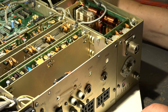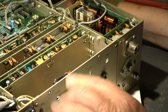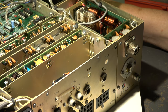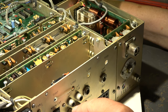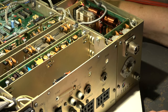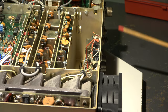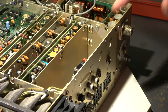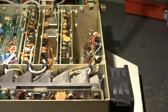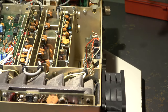These connectors are only opened when a pair of cinch connectors is connected to the companion R7 receiver, which has a Wilkinson power divider inside. There's a switch on the front of the R7 to decide antenna routing. The short has been clipped — I'll undo it, resolder it to the original state, and remove this relay. This relay appears to be connected also to the accessory connector and the VLF antenna input.